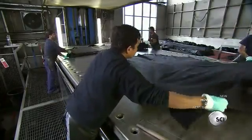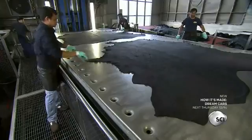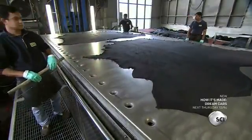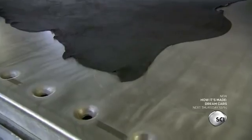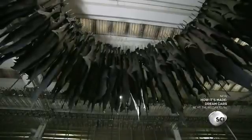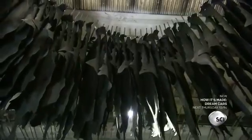Workers lay out the hides on a stainless steel table and flatten them with rulers to remove wrinkles. Once the skins are flat, the plate moves upwards and heats up the fabric for the vacuum drying process, which removes the remaining moisture. Coupled vacuum and vapor compression suck the humidity out of the hides. To finalize the drying process, the skins hang to dry at room temperature, exposed to air.